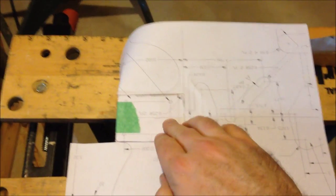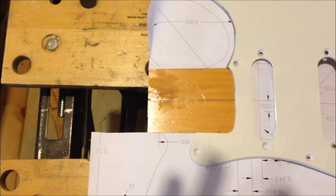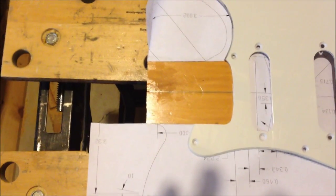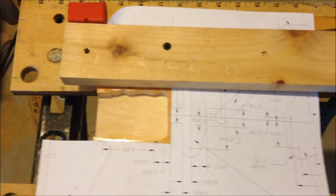Here's a trick: get the piece set down first, then glue the paper around it so when you're ready that's what you're routing out — except for rounded corners. This is actually a Tele neck, so what I need is my pickup cover scratch plate. When the time comes I'll get that tone knob off, line this up, and use it under the router to get a nice perfect rounded edge at the front of the neck pocket — awesome, because I already know this fits that neck perfectly since it came off the same guitar.